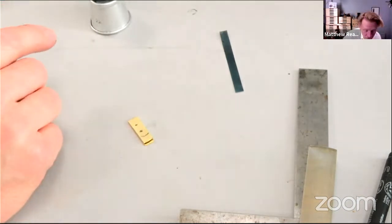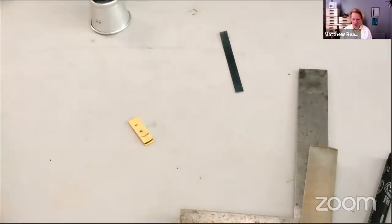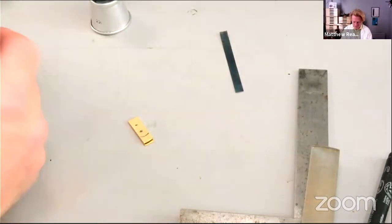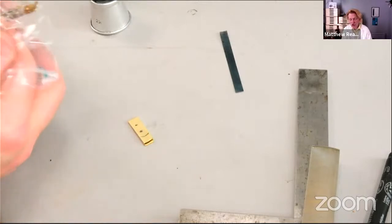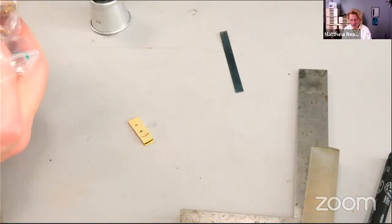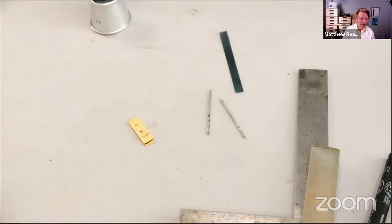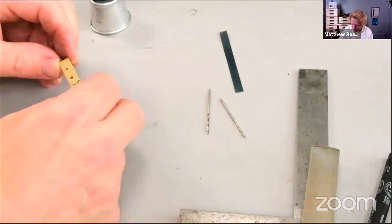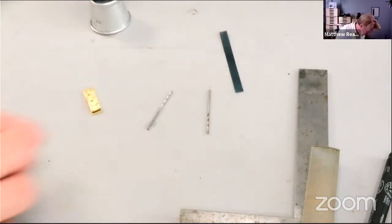Now I'm going to have to use the old hand drill, I think. Well, I will, because otherwise it's the Archimedean drill or nothing. If we've got a drill that's even remotely sharp. When you're drilling on a drill press, like a bench drilling machine, as any half sensible person would do, then brass is really terrible for grabbing. So make sure that the work is clamped. Otherwise, you will end up in difficulties with it. Just sharpen that drill up a bit.